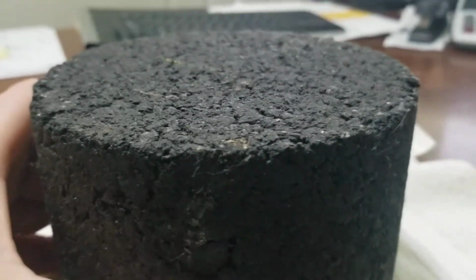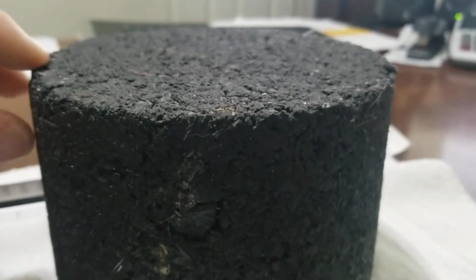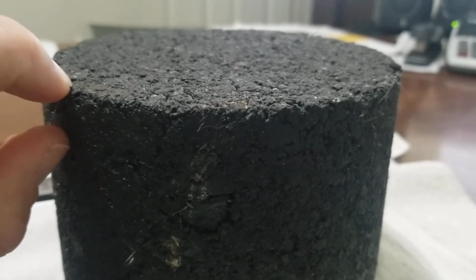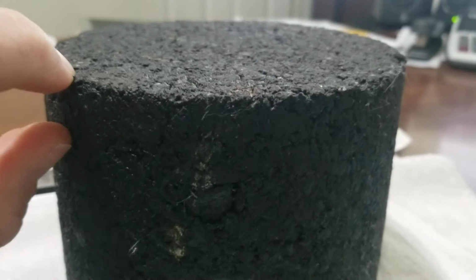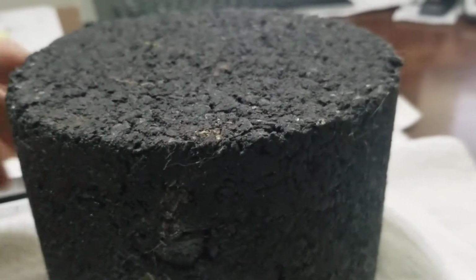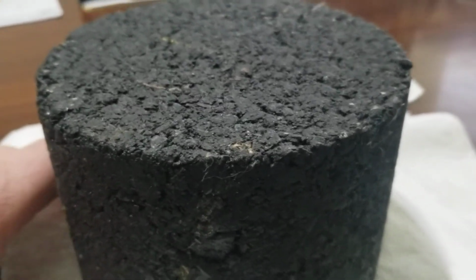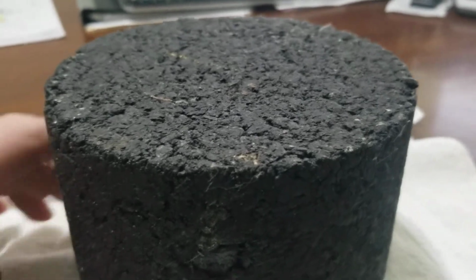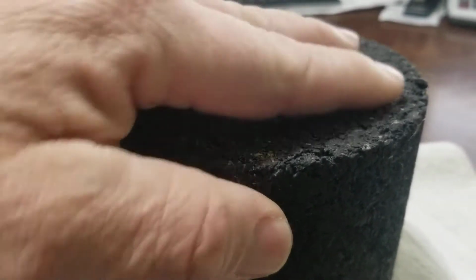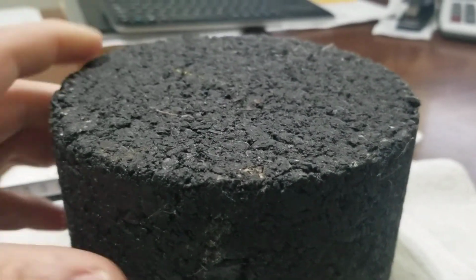We use a rejuvenator, and it's applied with a computerized machine. Our goal is to inject the blacktop and get 3/8 to a 1/2 inch into the surface of the asphalt. And if the wind's blowing, we can still shoot it. We can shoot about 10,000 square yards a day with a machine. If you live in an HOA, we can do 1/2 of the road one day and basically cone it off, and a day later we come back and do the other half.